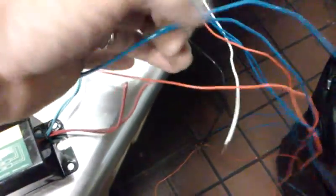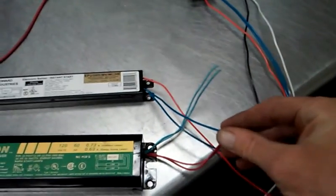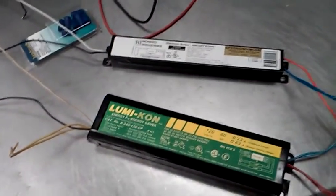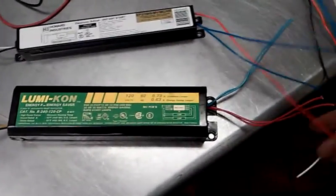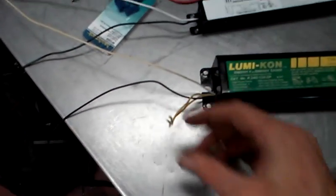The difference changes here. You have two blue wires, which are your positive input wires. On your fixture that you've cut off, you'll run one of the blue wires to both reds that you've cut down, and your other blue wire to both blues that are cut down. And then this red main wire here is actually your ground, so that will go to both yellows.